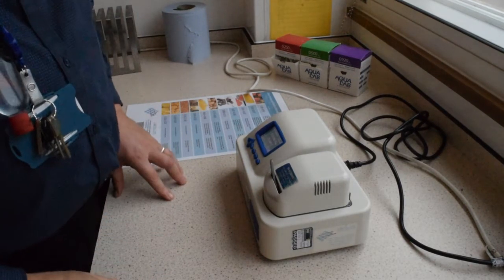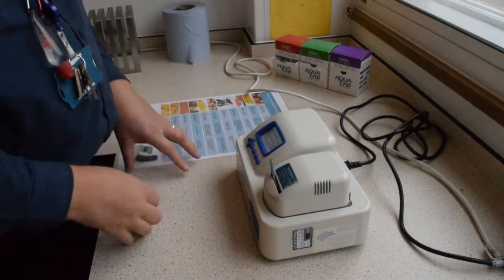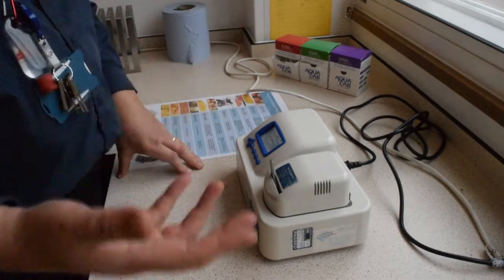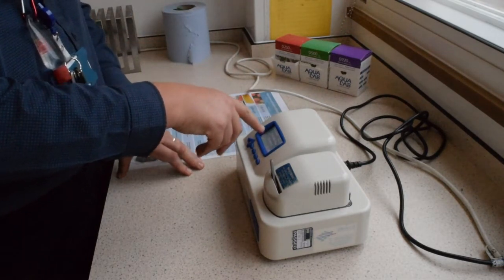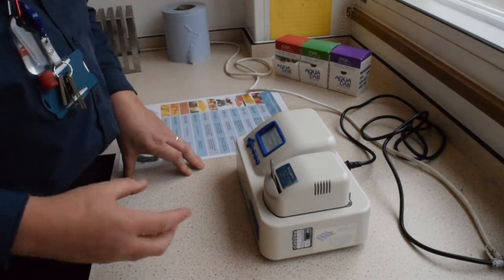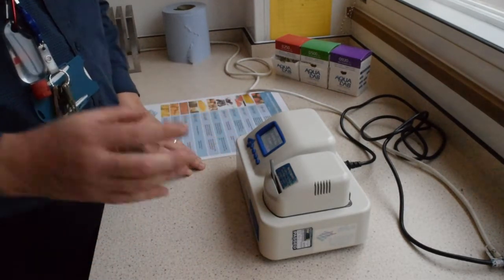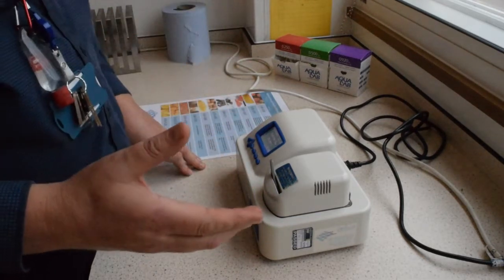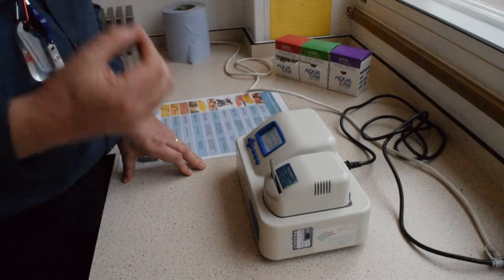When the test has finished running you'll hear a little beep — beep beep beep — indicating the test is complete, and you can read the measurement on the screen. For example, this particular sample is reading 0.9190 AW at 25.04 degrees C. It's very important that you record both figures, as AW is affected by temperature. Record AW at degrees C, not purely AW.